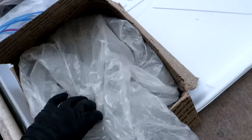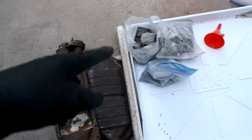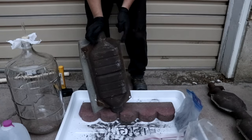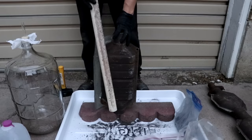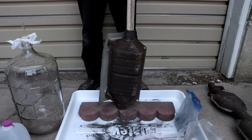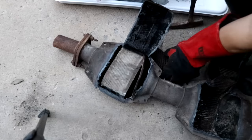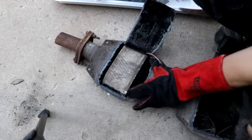Because of that, I'm going to be omitting the eBay material from our run. We're just going to have material from about five catalytic converters and see how much metal we can extract. The first thing we've got to do is get the catalytic material out of the converter. You can either cut it open with a grinder or take a rod and just beat the material out. I ended up cutting this one open because it was rather hard to rod out — the two-chamber design makes it difficult. You can see it's got a stainless steel mesh surrounding the ceramic core, which we don't need.